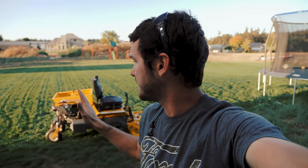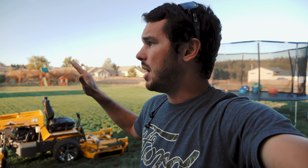Alright guys, so we are all done. As you guys can tell, this mower does so much better. You can tell that it's a really nice cut in this type of grass. The reason why I want to continue this video was to show that I'm not harping on Walker saying it's a crappy mower — this is a great mower. One thing I love about it is the deck: not only does it fold up, but it has a true floating deck where you're getting a really good cut. This is actually fairly flat because I graded it myself with my tractor, but a lot of properties will typically have dips. With this being a 48-inch, it helps — the 60-inch sometimes scalps in those little dips and doesn't follow the terrain very well.